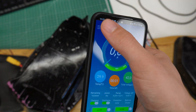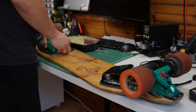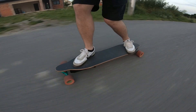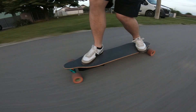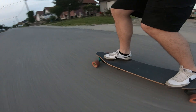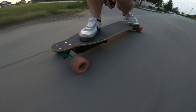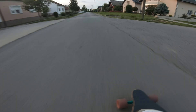The battery is fully built and now is the time to try it out. Once it was fully charged, I installed it into my enclosure and I went for a quick ride to see how it performs. Once I got on the board, I immediately noticed a huge power increase, since my old battery was sagging a lot. I also tweaked some VESC settings, and now I was able to hit around 43 km/h, which was awesome. Let me know if I missed anything, and definitely don't forget to subscribe since we are so close to hitting 10k subscribers. Thank you for sticking to the end, and I will see you in the next one.